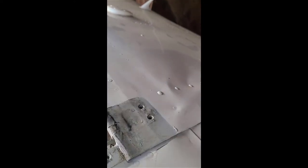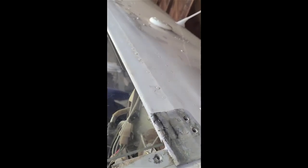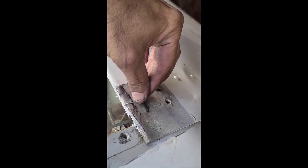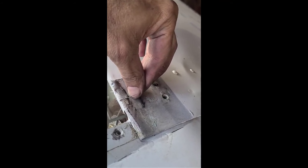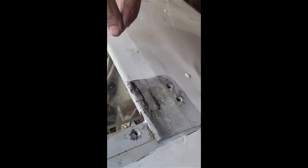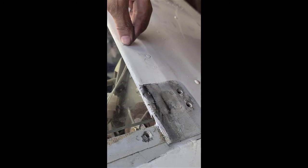Lessons learned: I sat the window in all of the channels with the window on top of the cabin, and it's only about a half inch back. If you can't get it within a half inch of the edge of the aluminum, I don't think there's any chance you're going to do this method. The LP Aero window needed absolutely no trimming. All I did was sand the edges and make them super smooth.